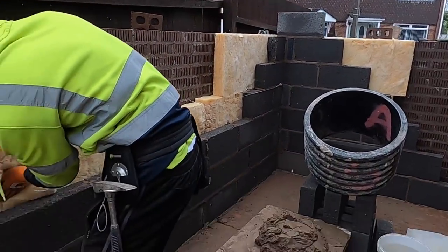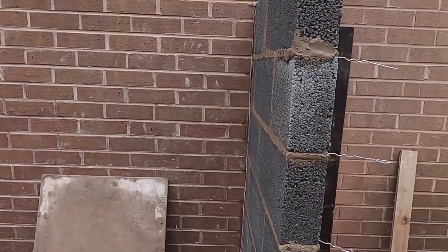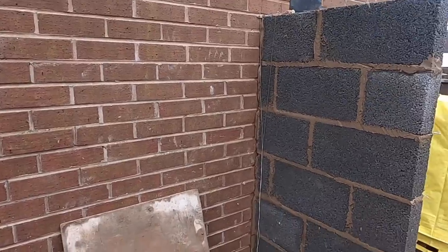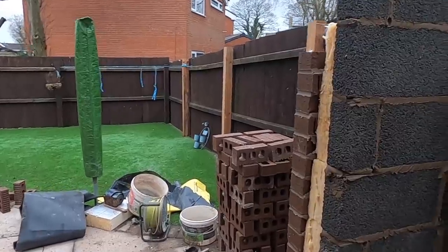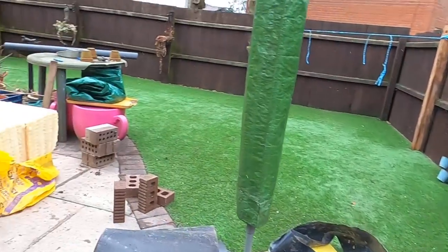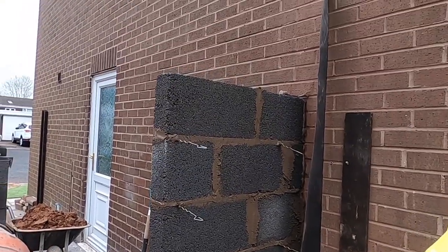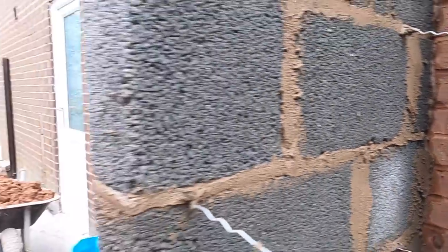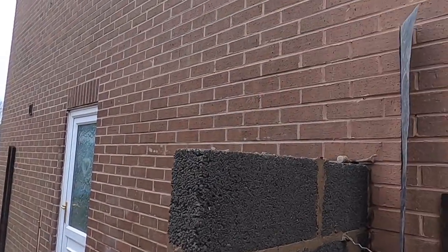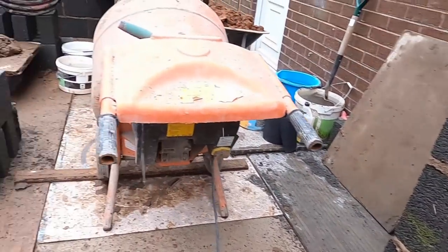So Alex's corner's up, he started running in. My corner's up. I've got this blockwork in. So that's our doors set out. So now we're going to leave Alex running in. I'll get a mixing first. I'm going to get this face panel up. It's quite sheltered, I'm sure. Here's the vertical DPC before anyone shouts at me. Ground into the brickwork. Pointless, but keeps people happy.